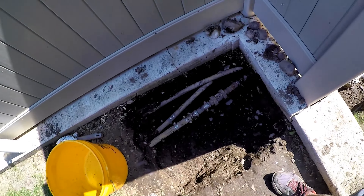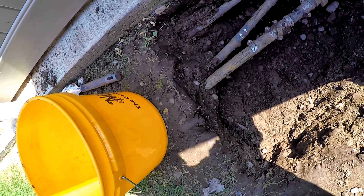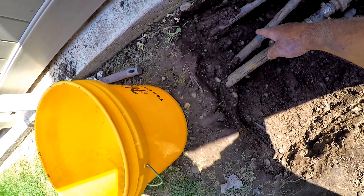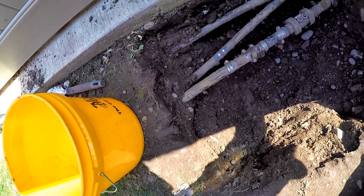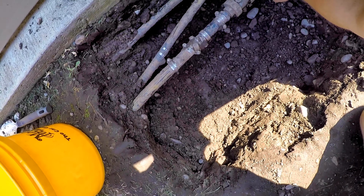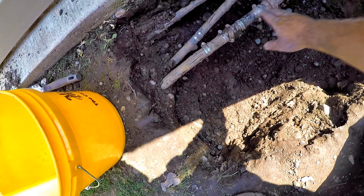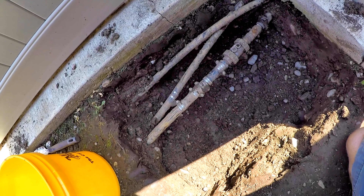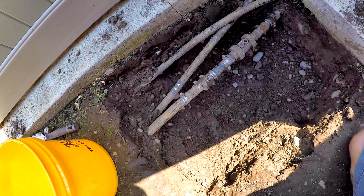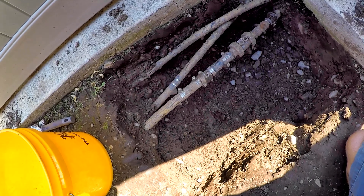On this side it's going to be a challenge because I didn't know these lines were here — the box came down and excluded them. I'm going to try to get this line shifted over a bit and then get the box down. This here is a broken ball valve handle on the backflow. I'm probably going to see if I can get that replaced with something better, and also add a quick-access fitting to blow out the zones.